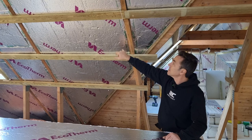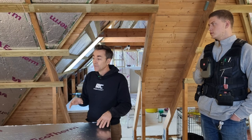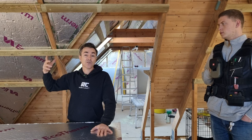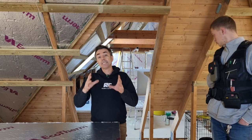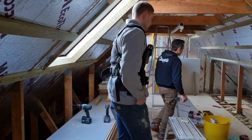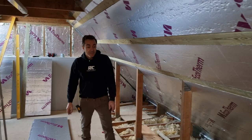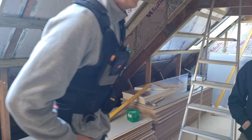Underneath, in this instance, we're using a 25mm thick rail all the way through to catch the boards, then going in between that with another layer of PIR at 25mm. So altogether we're using around 150mm of insulation overall. Going back not so long — maybe 10 years — we'd use 50mm in and 50mm under, so 100mm total, or sometimes 75mm in and 25mm under. But again, it all needs to be worked out on a job-by-job basis. The guys are doing the internal skin here, taking it all the way down to the bottom and all the way up to the ridge.